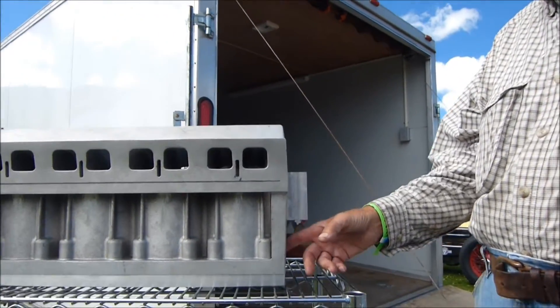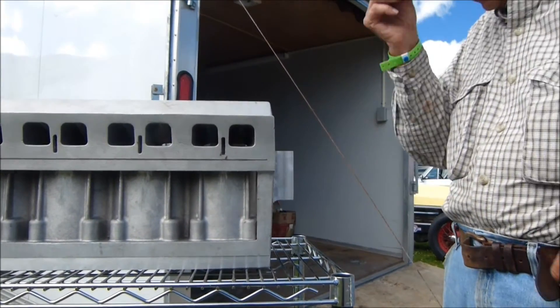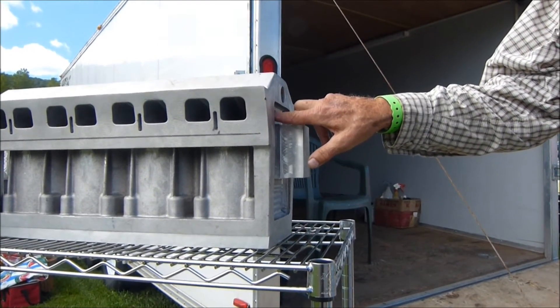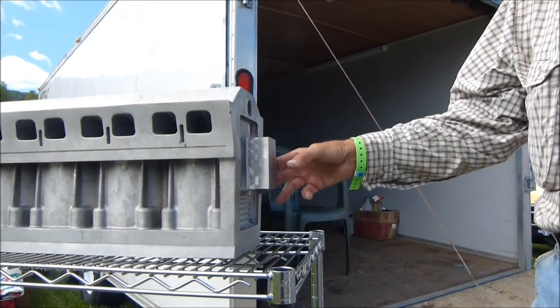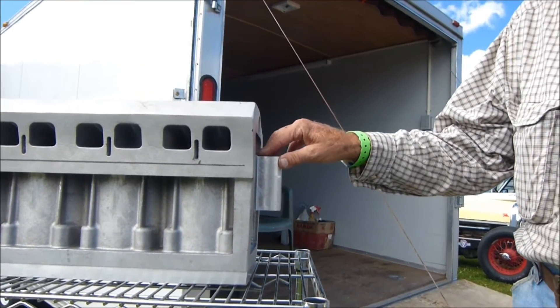So with this off, I did by hand — made sure all these passageways are clear. And then this here, you can't really do otherwise. We had cast a couple of dimples here because you couldn't cast this hole. And then with the dimples, which were for alignment, I can drill these holes and make this slot. So that afforded keeping this open — let me know that I got water going around here.